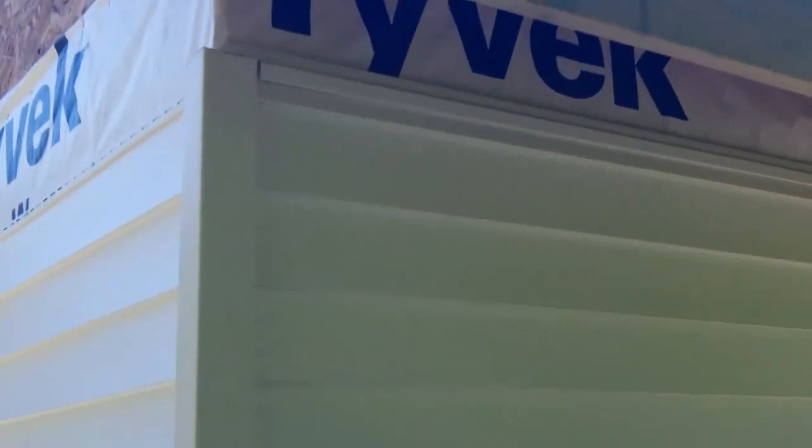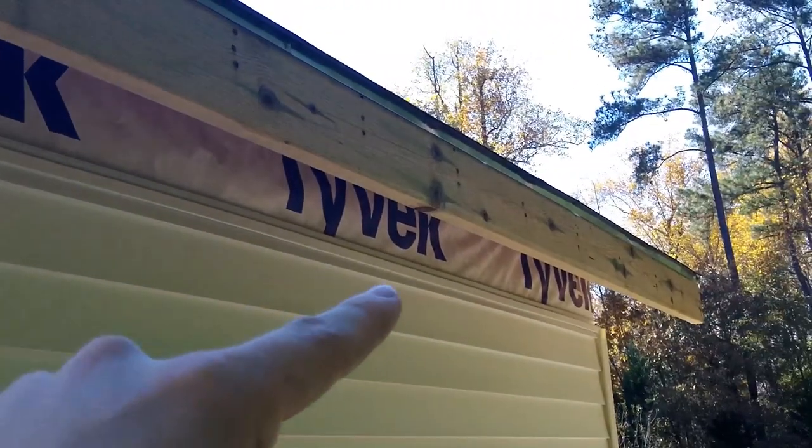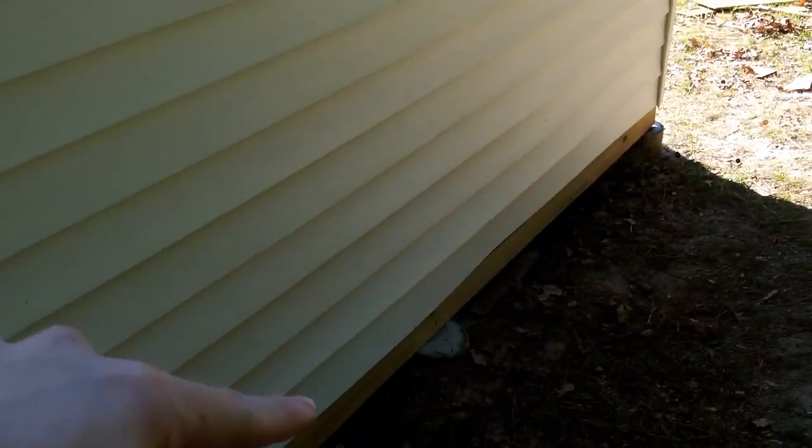There's another corner and another full side. The way we did it: we put the soffit runner up first, then we put the corner pieces on, then we put that top pocket on. The very last thing you do is put the siding on starting from the bottom going up. It's really easy and goes really fast. We used roofing nails because we had a lot of those left over, and they have a big head so they hold the siding on pretty well.